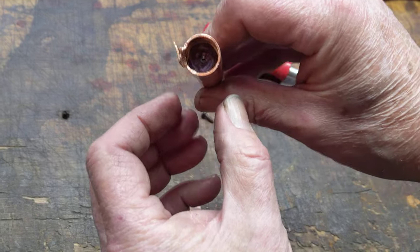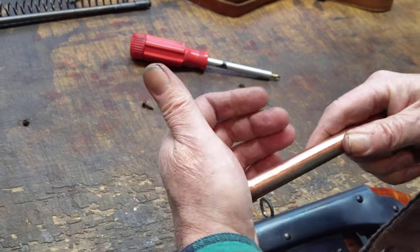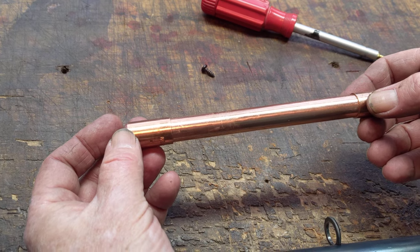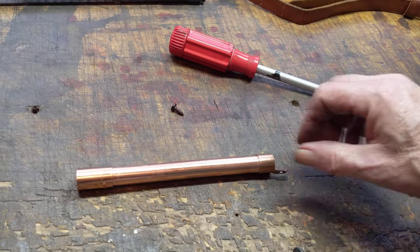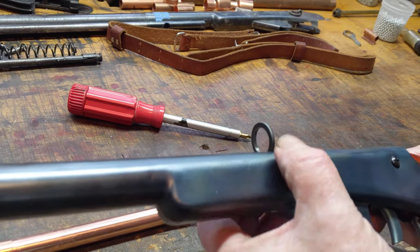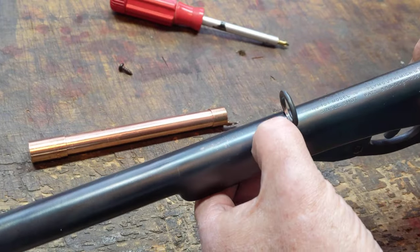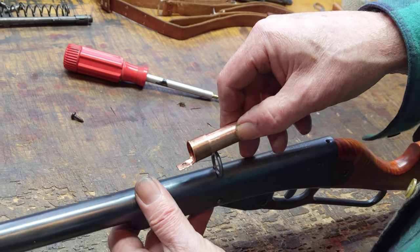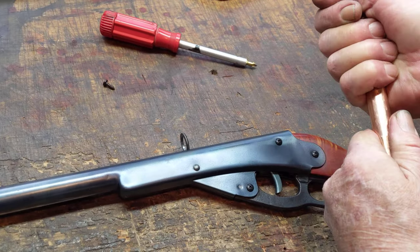The back panel is put on the same way. That's a little steel washer we drilled a small hole in, and this is what basically makes up the body of the rear scope. You get the effect of having a scope by having the 5/64 aperture — that basically makes things look bigger even though it's all the same size. On this one, I decided I would build a spring stop that had a large enough loop to accept the copper, and that would give me the forward mounting point. I believe I'm going to redo this and drill an access hole at the base of the receiver and put a small louver up here, because on the original design it was just a tab in front and a tab in the back. You slip the tab in front into the receiver, you screwed down the tab in the back, and it was as stable as it needed to be.